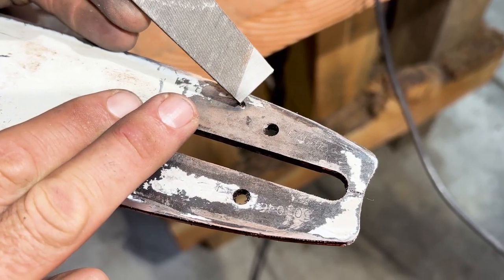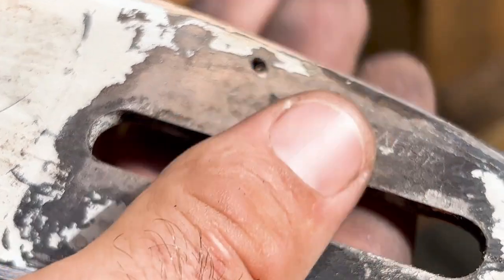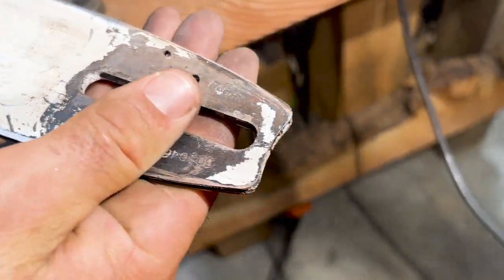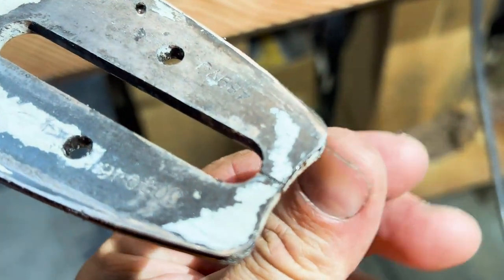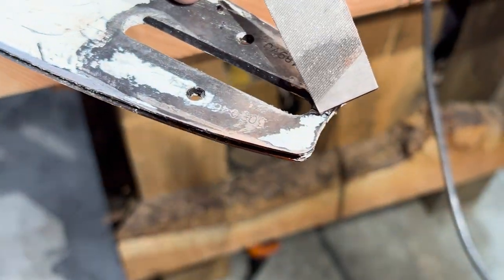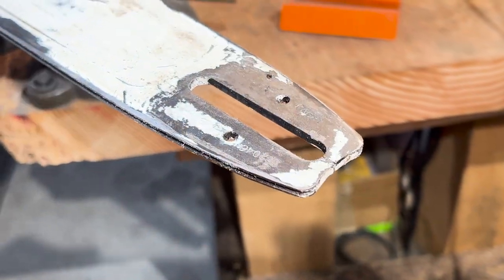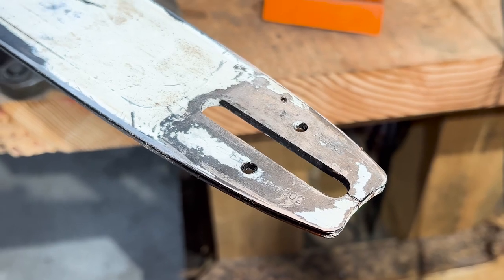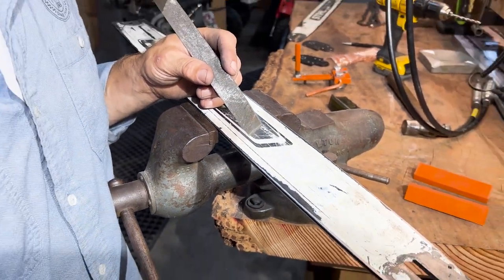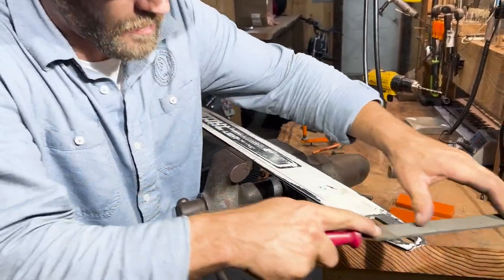Look at your oil holes — with brittle metal it can happen to Stihl bars, Oregon bars, Cannon, Stihl, all of them — sometimes you'll get a hairline fracture in that area. The drilled hole makes a weak point in that part of the bar. With leverage from all the way out through the bar it takes a lot of abuse. Some brands cut a slot in this portion near the mounting ears and some don't — that slot lets the ears move a little bit to relieve pressure without creating a new crack.